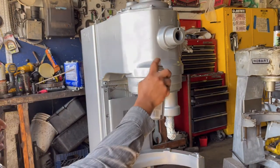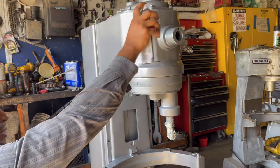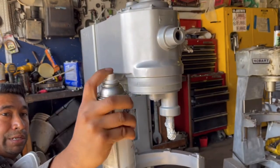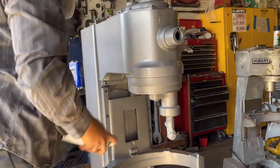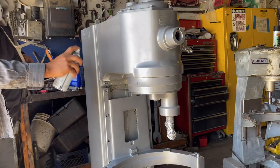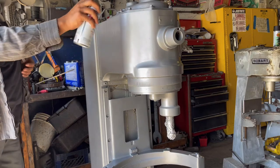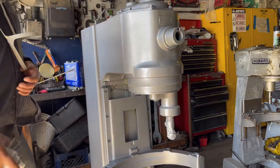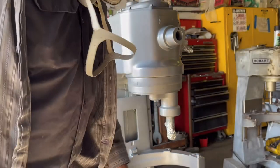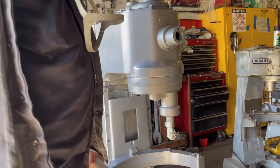But this distance, with this movement, like this, this is how I would do it. And not too slow. Like I said, the speed is important, so the clear doesn't run on you. Giving it about 5 minutes.